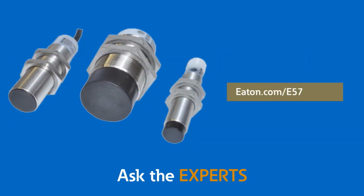There are other sensors that are known as unshielded sensors. You see that in the picture, the sensor in the middle and the sensor on the right, where the coil and core are extended from the front of the sensor. Those sensors have longer ranges and are less resistant to detection of metal in the area. You cannot embed those directly into a metallic surface in the machine or wherever the application environment puts you.